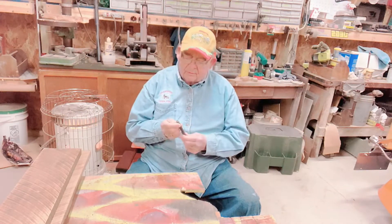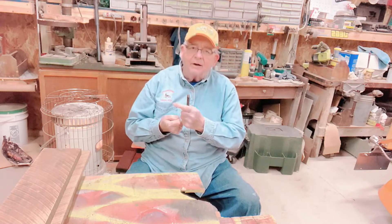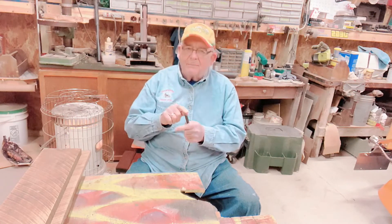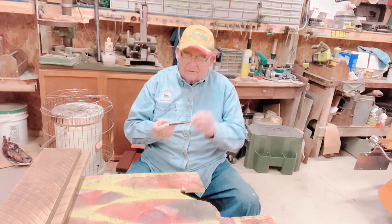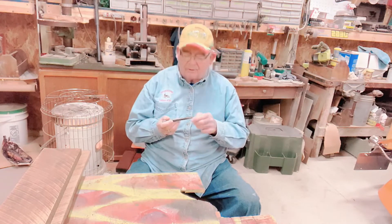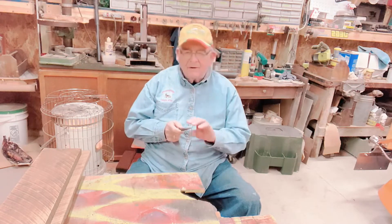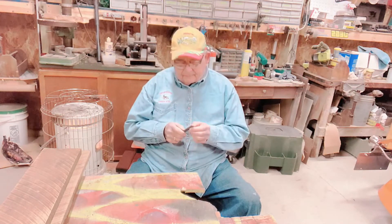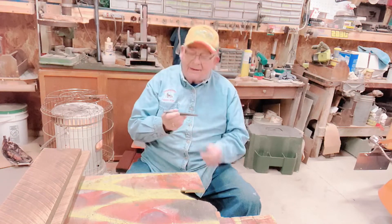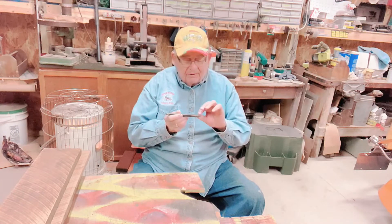On the other end, though, you want it to be soft. When you hit it with your hammer, you don't want to smash and break your hammer or put dents in the hammer face — you want it to be mild and mellow. So we heat-treated this end hard; we even case-hardened it by heating it to a certain temperature and putting it in carbon, adding carbon to the outside to make it harder.